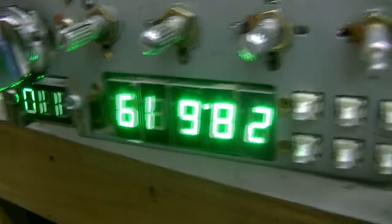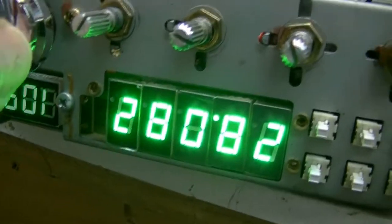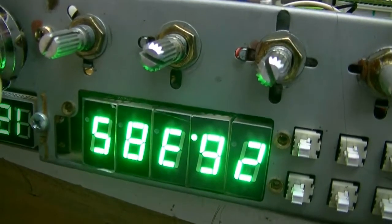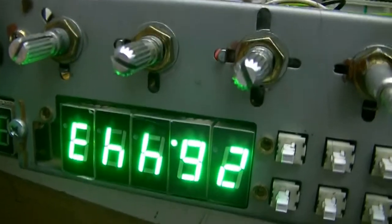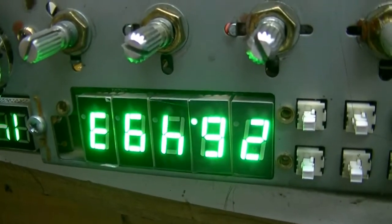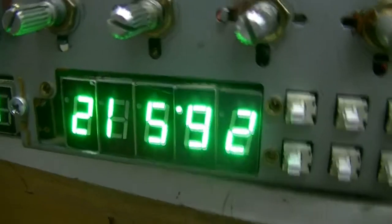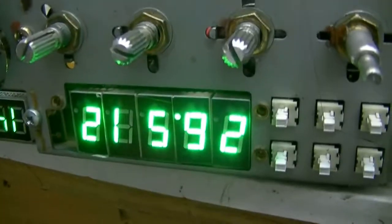28.619 — it just came unlocked. All right, there we are, back on 108 — 28082. And then once we get back up to 26440, 445, 454 — see it starts working again. So that might be handy for getting down to 26512, but the display doesn't match. I'm wondering — well, now I'm just going to go ahead and replace the PLL.